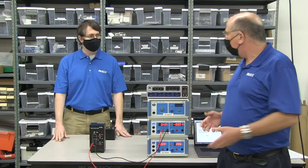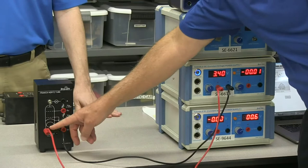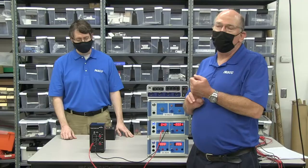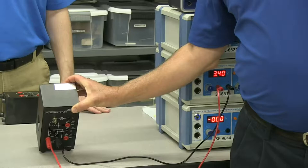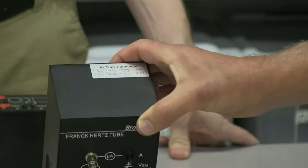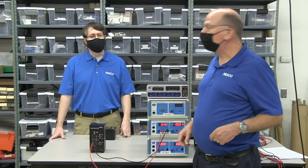I thought I would walk through the setup and talk about the logic behind it. I already connected the Frank-Hertz filament to the tube to this power supply and set it to 3.4 volts because we need to warm up the filament for 15 minutes. How do I know what voltage to set it to? Well, there's a manual, a Word file, and a Capstone file. But it's better to look at the sticker on the top of the tube because some of these have different numbers — these are suggested values. This particular tube said filament voltage 3.4 volts.